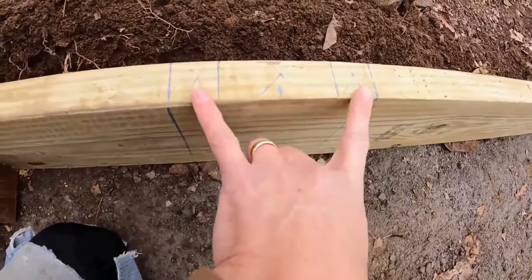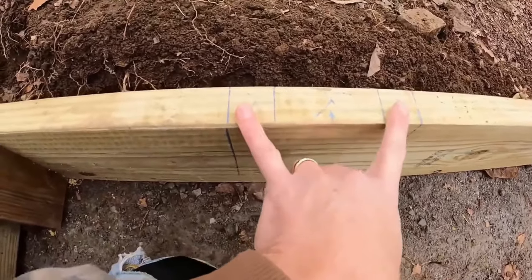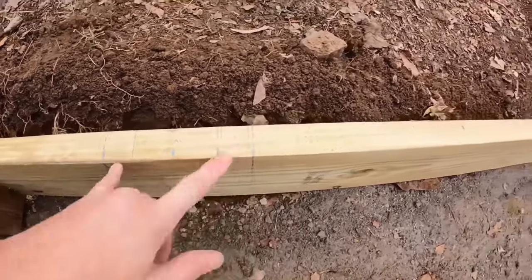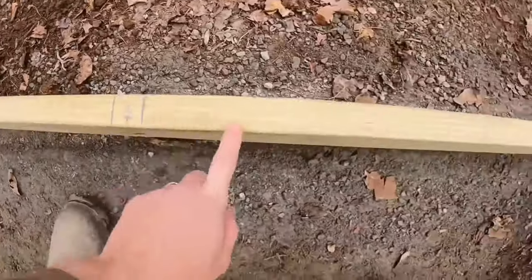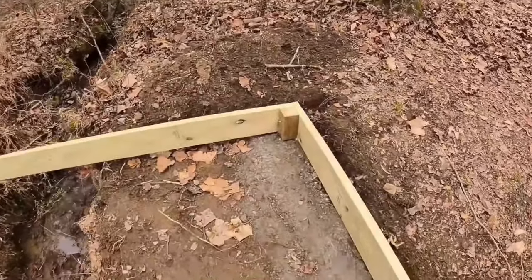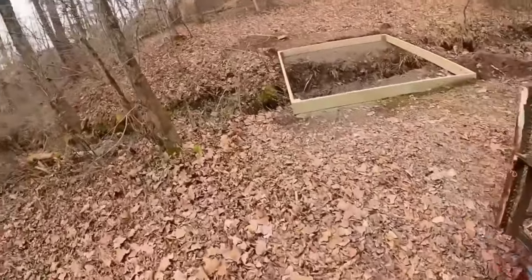This is one of those beams that I built, I guess you could call it. It's a double, but it's a pulled up joist with a 4x4 in it, but you can see a wide spot here. You can see it's a single, another double, single, and another double. First thing I'm going to do is make sure this is nice and square, and then I'm going to put some support braces on here where I know it's not going to move anymore.